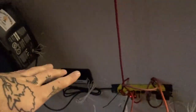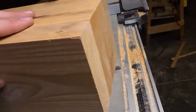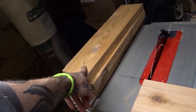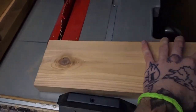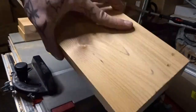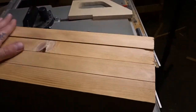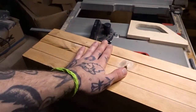The wiring in here is sketchy at best but we got all four pieces cut. It's probably very even now. I have the back end lined up. I measured out how long each of these need to be so that the backstop limits exactly how long I need it, and this keeps it all nice and square. I'll use my little push tool to guide it along and we'll just take off just the corners. We've got them cut to length on the other side too. Now we have some even pieces of wood to work with and can start laying out our joints.